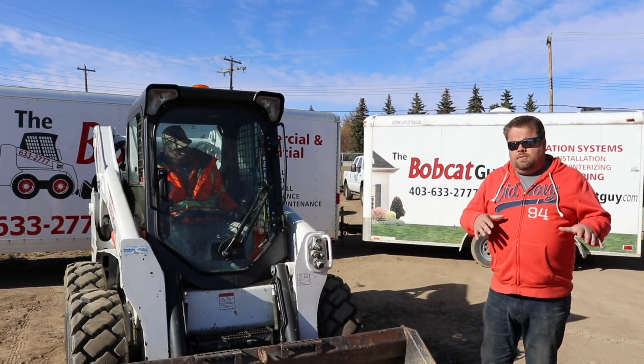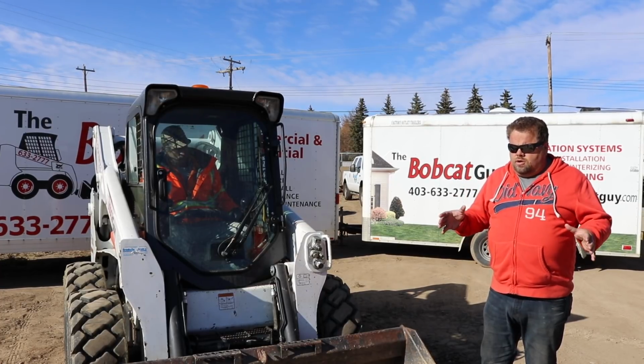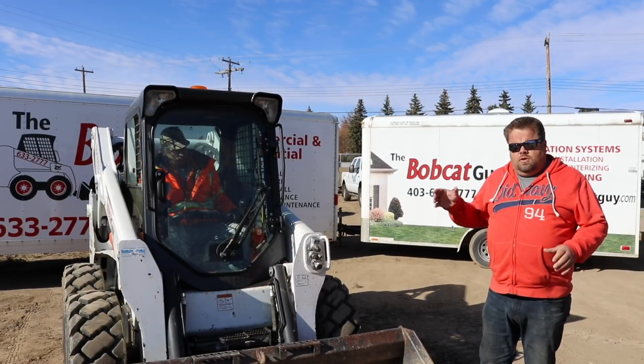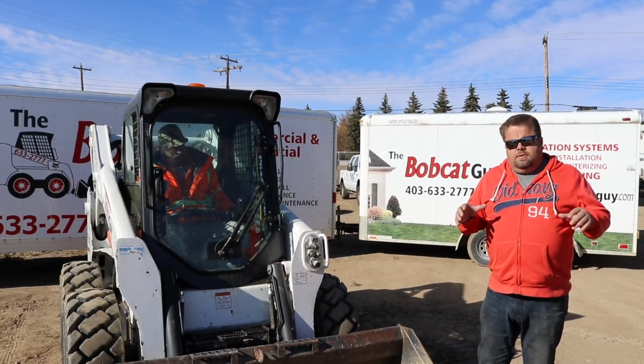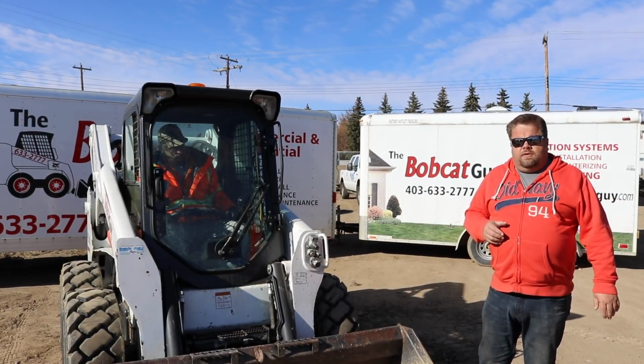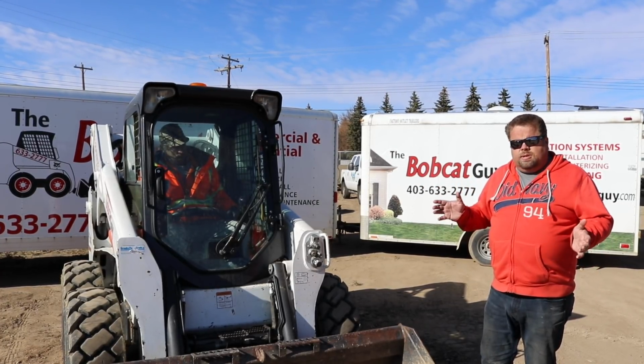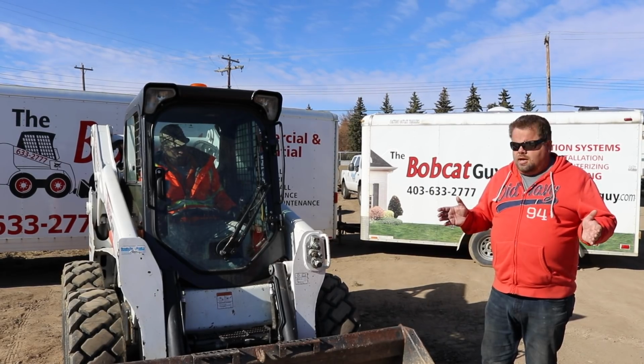So if you've got 3 people on a job site working, or at home working in the backyard, make sure the operator himself knows where those 3 people are all the time. And that's why I always say stay in front of the equipment, stay in eyesight of the operator, and everybody will be able to go home safe at the end of the day.